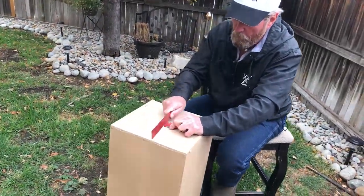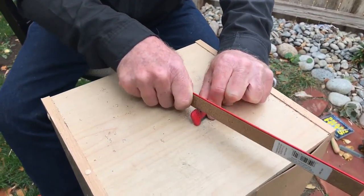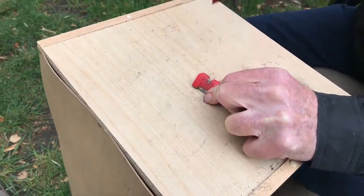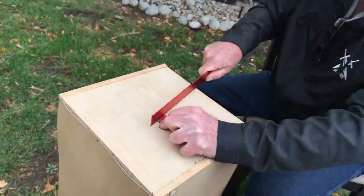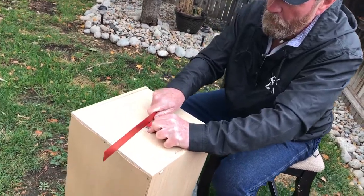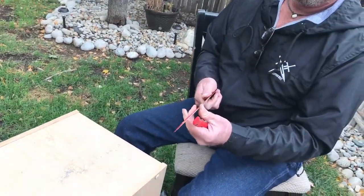It's going to take a little bit to actually cut a sixteenth of an inch down to a fine edge. You've got to take at least a 32nd off of both sides — on a 12 to 14 degree bevel, whatever this V-notch is on one side, 22 to 24 degrees overall. Let's see about where we are.